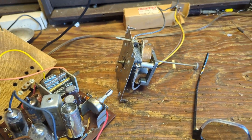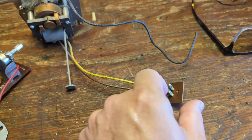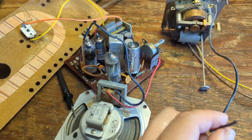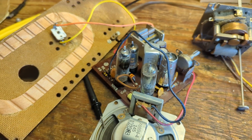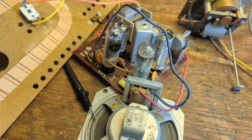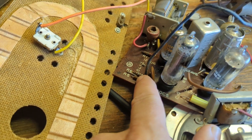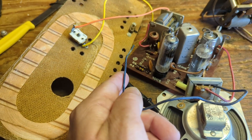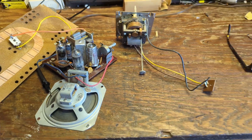There's one lead coming off the chassis. My assumption is that the brown lead goes here because that's one side of the incoming AC, then the other goes to the switch and then to chassis. I can see a little burnt-off part so I think that's where it goes, but I'll solder it back in to confirm. There's also a blue wire that's come off too — there must have been really poor solder joints on this. It's completely coming apart, but it's easy to fix.